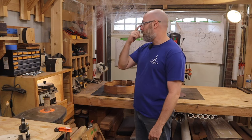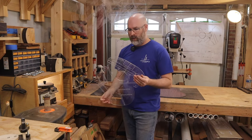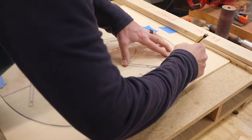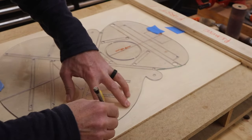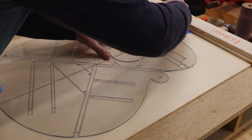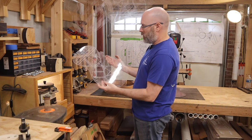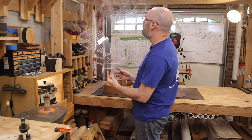We're just about ready to head upstairs, but I wanted to mention that we invested in some CNC technology last year and we're now able to create templates. This is a template of one of our guitars — it allows us to mark where the braces go to be glued onto the guitars, it helps us mark out the outer dimensions when cutting our rough stock, and it also allows us to use alignment pin holes to keep things lined up. When we were able to start making these, it really changed our shop — it made things a lot better and a lot more accurate.